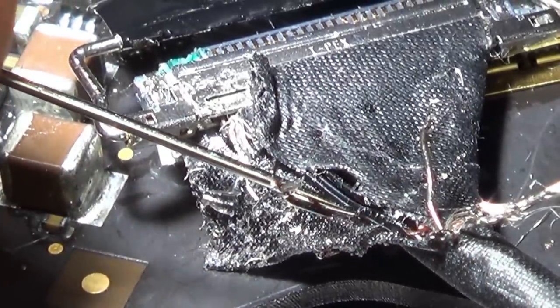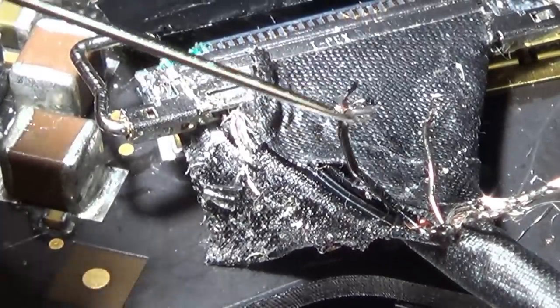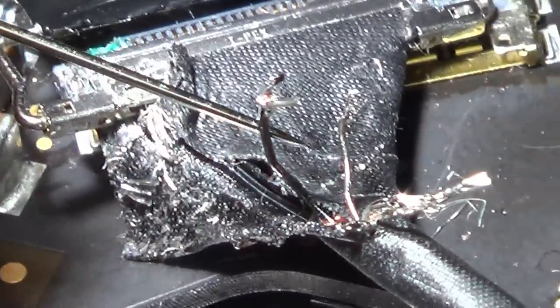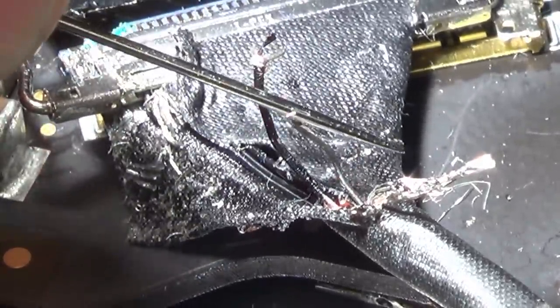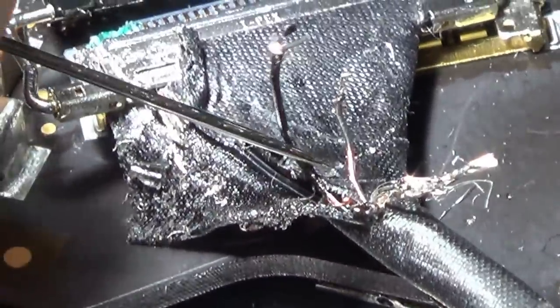But that's not a single wire. It's a coaxial cable. So basically you have a thin cable in the middle, and then you have a load of wire wrapped round that one there. So I presume the outer one is going to be ground because it is short into ground. And the middle one is here. So forget about this black one, it's just getting in the way. There, this one here, that's on the needle now. That's the middle one, which the signal's going down. Super, super small. Look at my finger.